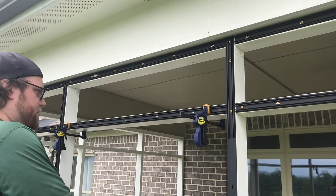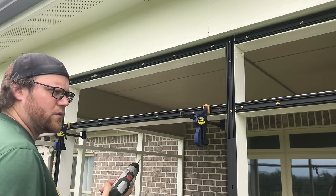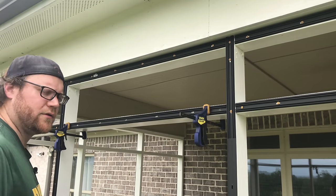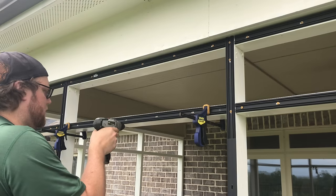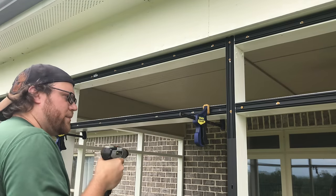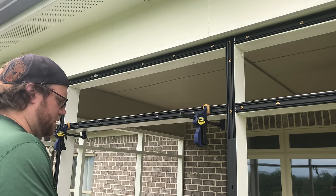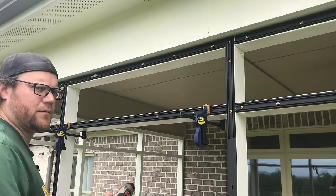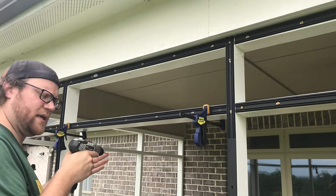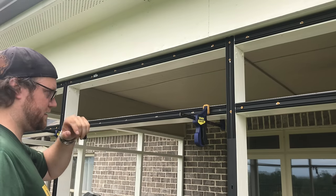All right, get your drill. I'm using a 3/32 drill bit. You can use 1/8. I just want it a little bit smaller, since the smaller it is, the less wandering it'll do. Find your holes and put the drill bit dead center and push hard to make an indentation, to kind of self-center punch the hole. When you apply pressure and put an indentation in, it's less likely that the bit will wander and get off center.